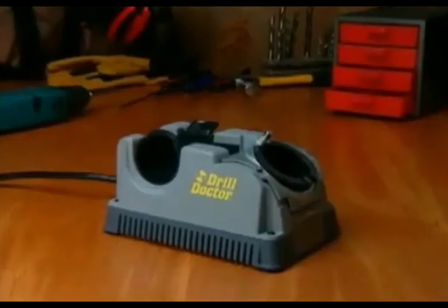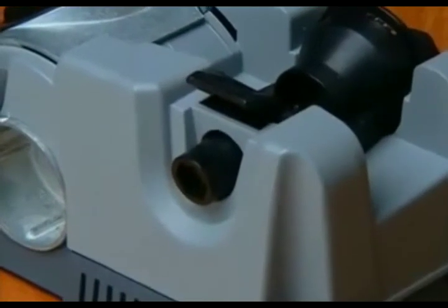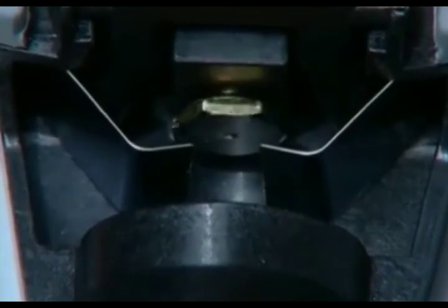If you have a Model 750X, you will need to adjust the material takeoff knob before you begin. To set, turn the knob counterclockwise until it stops. Then, turn clockwise 3 marks on the knob. This is a good place to start for most bits.